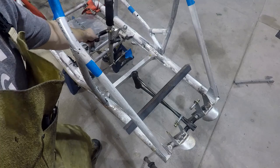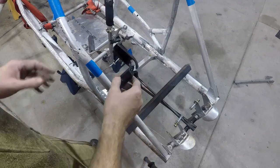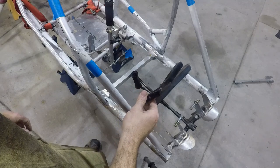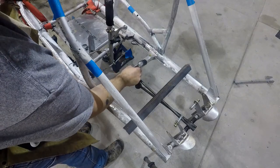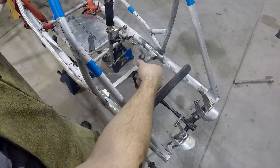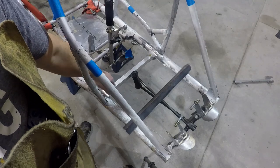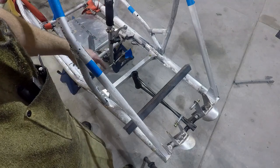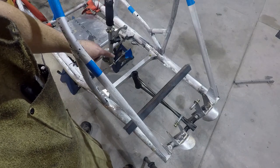The other thing I found, obviously this was really boogered up, and obviously this round tube was on there, and it obviously had been broken off and sort of welded back on, but this is the preferable square tube, round hole. So since I'm replacing this tube anyway with round, I had this aluminum tube just sitting around. This is a same wall, I think it's 120 wall, 6061, I think it's T651 extrusion. Just happened to have it laying around, and it allowed me to do a bolted connection here.